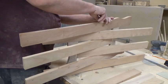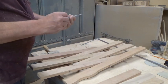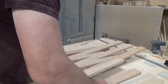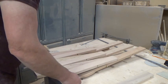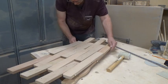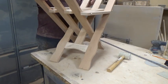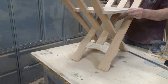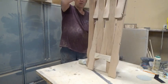Now we're going to do an initial assembly. We're going to start with the bottom of the legs, then we're going to do the seat slats that get spaced between the legs and the center stile — three per side, both sides. Finally, we're going to insert the center rod to lock everything together. Everything looks like it's fitting and moving perfectly.